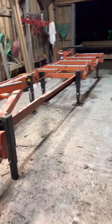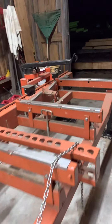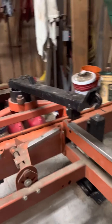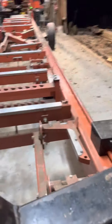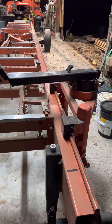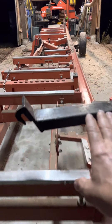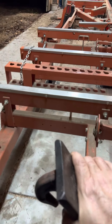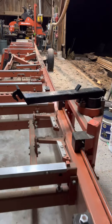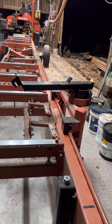I'll take you down on the end because somebody might be asking, what the heck is this? My door openings on the sawmill are 21 feet, so any log longer than 22 feet I end up coming in through the short door here in the back. I put the log tip on here — this is a trolley, actually a sawmill head from Wood-Mizer cut down, so all the bearings are in place. You put the log right here and trolley it in with your loader forks, and it will walk it right down the line. That's how I put in a 32-foot log.